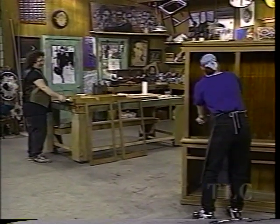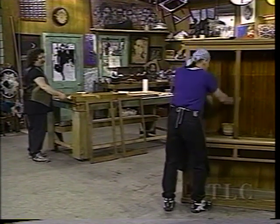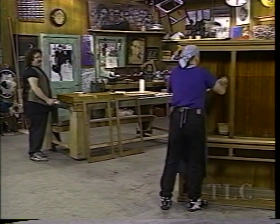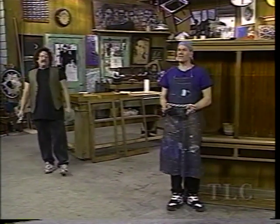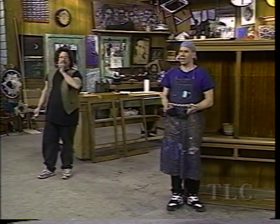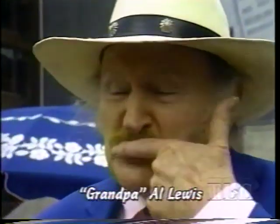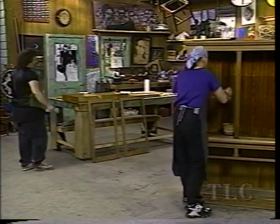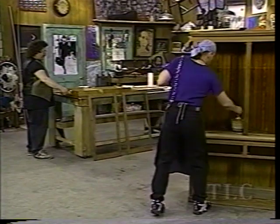Look, I'm chained, and I'm going to shellac the inside of the piece. You'll never guess what we're using to seal once again our wood. Mixed 5 to 1, it is called a spit coat. I'm doing the drawer fronts.